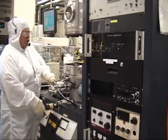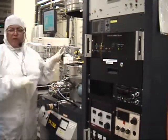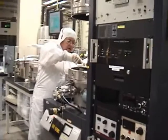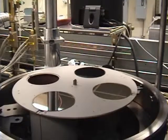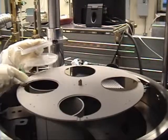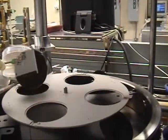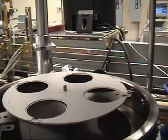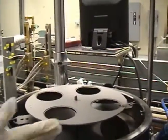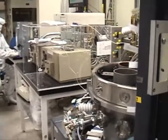You can now close the N2 valve — it's done its job. I am now going to remove my wafers at this point off the platen. Once I have my wafers off, I'll start to take all parts out of the chamber. Picking up your platen, setting it on the clean wipes, remove chimneys.